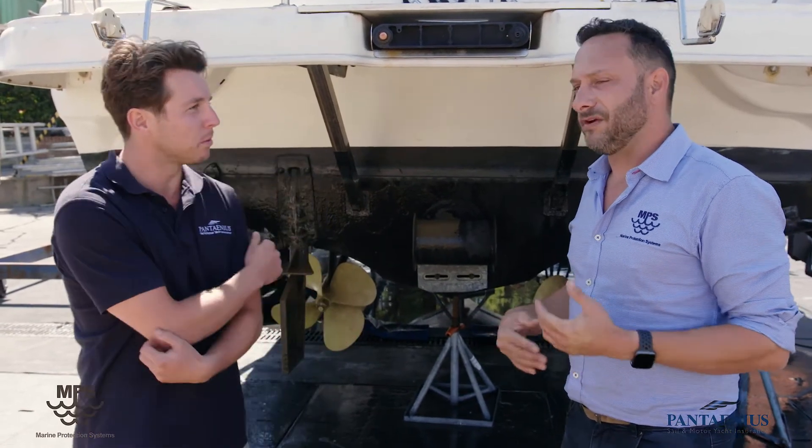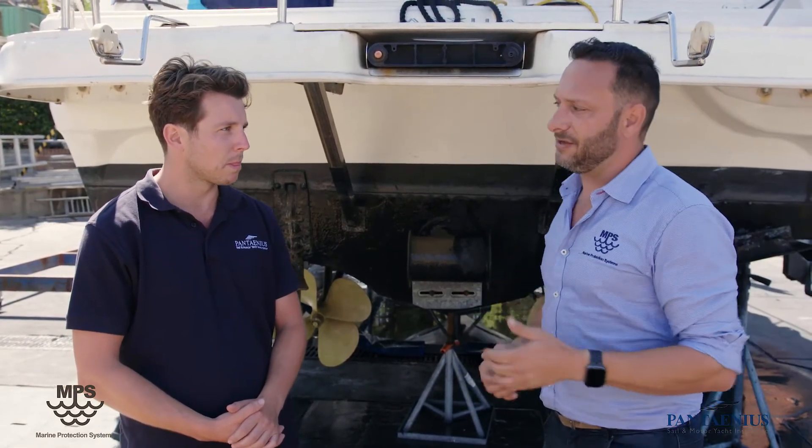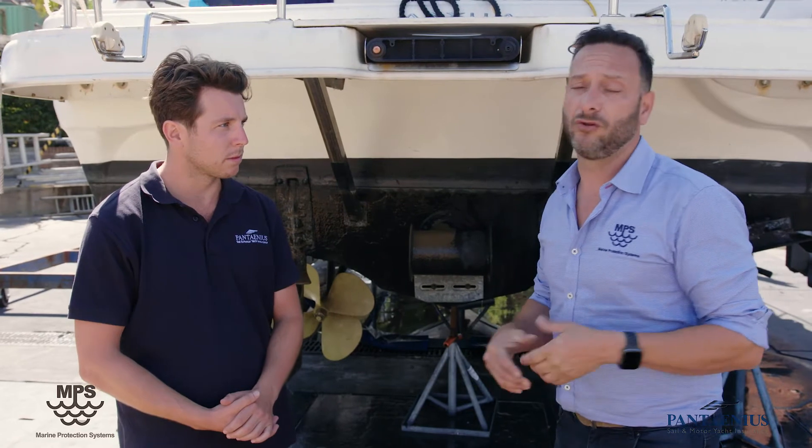Anodes can change based on environment, location, and usage — all of which determine whether your anodes work harder or less effectively. Best practice: I would recommend lifting every six months for a quick clean and assessment, then put it back in the water. If you've got a diver, have them check every two to three months — clean the hull, make sure coatings are intact and anodes are working. If you start consuming anodes at a high rate or your coatings are failing, we have a problem and we can sort that out. There are a lot of really good tools available to provide guidance through anode depletion, coating failure, or corrosion.